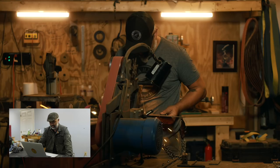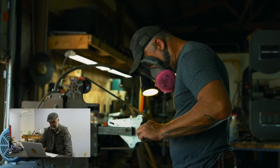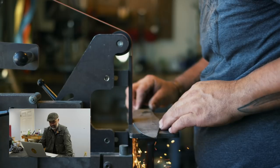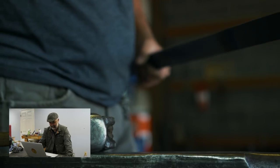Get some good glasses — don't buy cheap ones, get nice glasses. A hat keeps the sparks from coming in between your glasses and keeps sparks off your head when you're grinding. A respirator keeps fine dust particulate out of your lungs — especially bad when you work with certain woods or certain metals; you don't want to breathe that stuff. Safety equipment I don't recommend: gloves. I don't use gloves because you're never going to be able to feel what you're doing with gloves on. Your hand will be more sensitive to touching the steel, holding the steel, forging a blade, grinding a blade. Gloves are not going to assist you — they're just going to pull you into trouble. So I don't wear gloves.